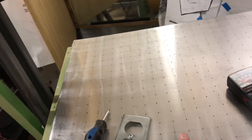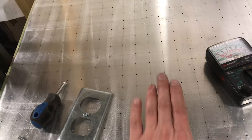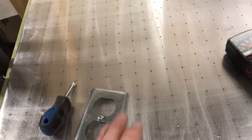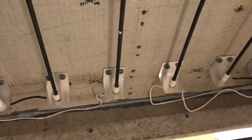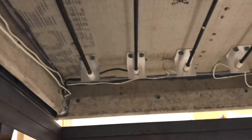This is a large plate — I think it's 18 by 24 — aluminum plate. I love how this works. These handles: you grab the handle up here and pull it down. The plastic is clamped down here. You have it up at the heaters, which are up here — these are all toaster ovens, used to be three toaster ovens. I took the heaters out of them and wired them up here.